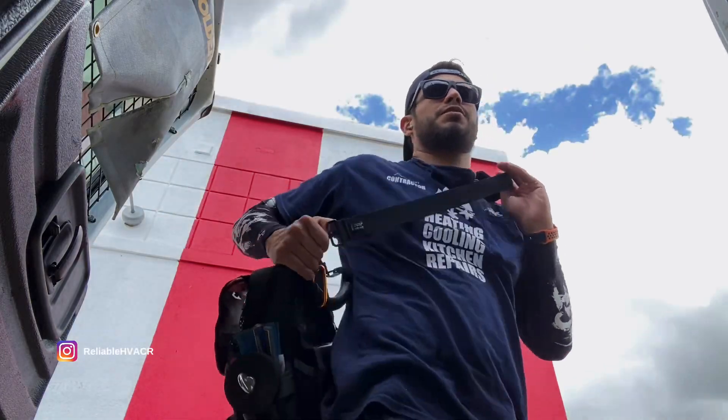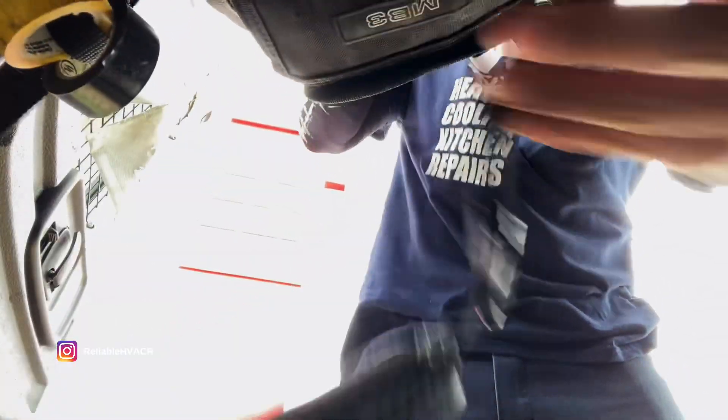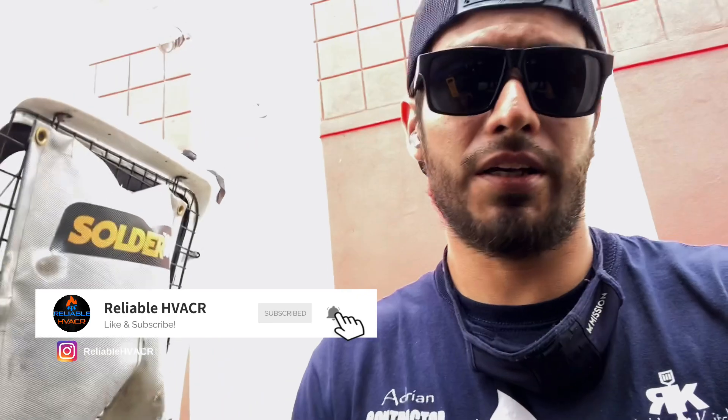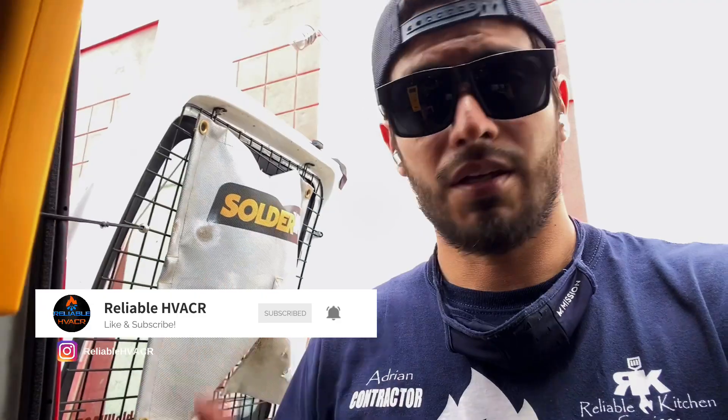As you saw there, it basically shut off at 32 — a little too low for the cooler — so I just adjusted it to three degrees higher. Make sure it cuts out, so it's gonna be like 34 or 35 — they'll be happy, and that's it. Just make sure you always check your temp controls when they cut out, because they're not always accurate. We're gonna move on to the next one and see what happens.